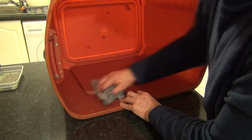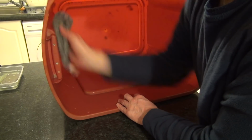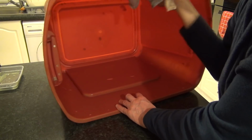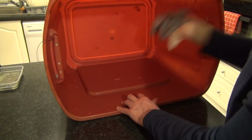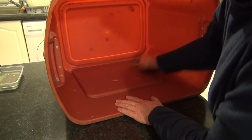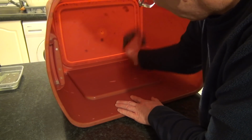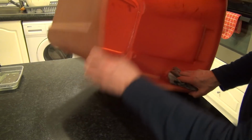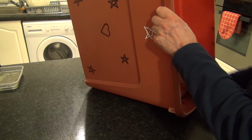Try to make a static and dust free area just now for doing the varnishing. It certainly helped with my second coat. First coat was covered in dust. I thought, why not cover it? And it seemed a good idea. And it was.